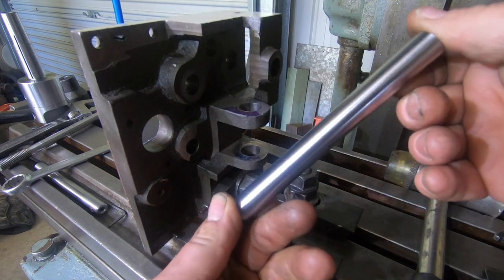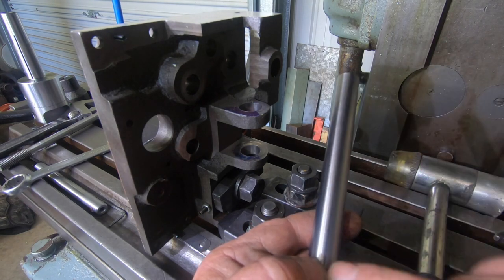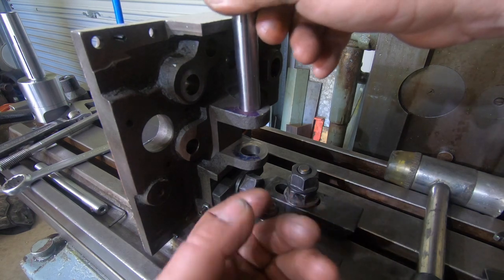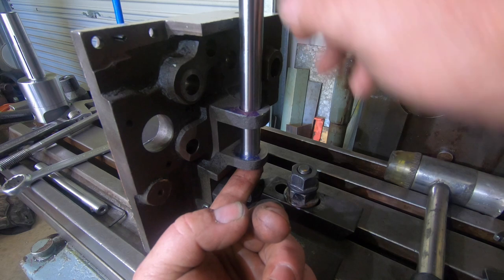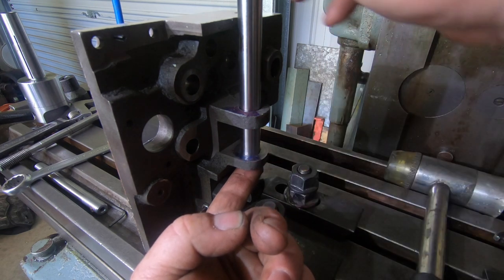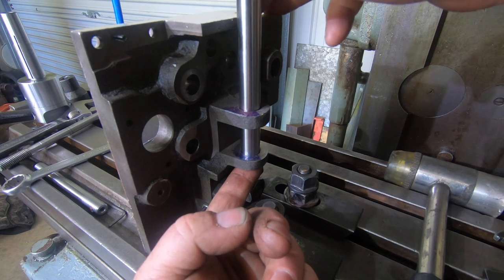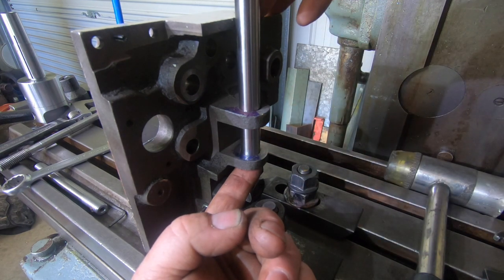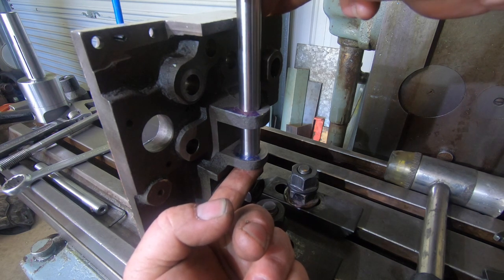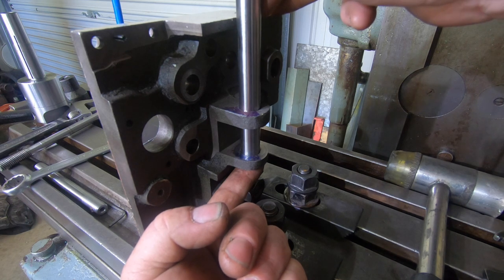So I machined up another head bolt. And when I measure it with a micrometer, it's about 3 tenths difference, or 2 tenths from end to end, so it's pretty darn good. I held it in a collet, brought it down, set a test indicator off the head of the mill, and just touched it on the side. Then I moved each axis until I saw it was down in this corner, which is the existing hole, going by the wear pattern in there, until I just saw some deflection on the rod. And that's how I've located the hole.